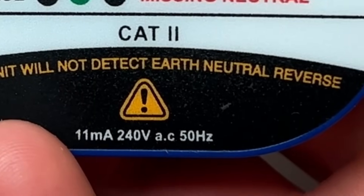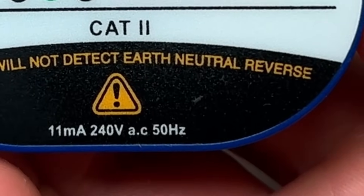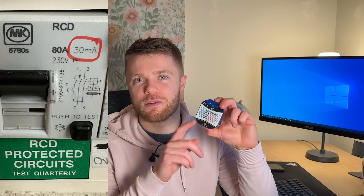Both LEDs will light up green for correct. The resistors in these are sufficiently strong to only let a small amount of current through, so they shouldn't blow your RCDs or RCBOs and cause those to trip — unless you've got other current leaking in your home and the addition from this could be enough to cause it to trip. But this alone wouldn't cause them to trip; it just leaks a few milliamps. You usually need about 30 milliamps to trip an RCD.